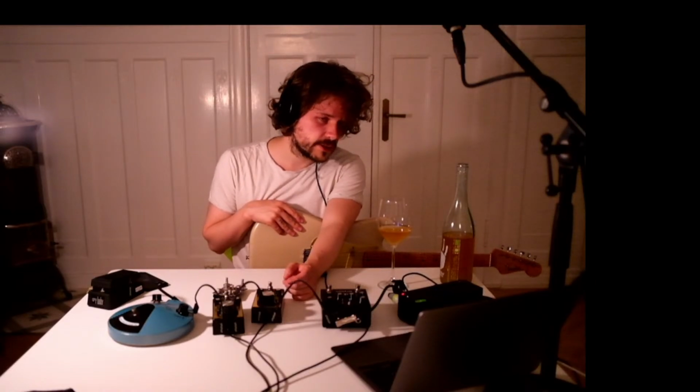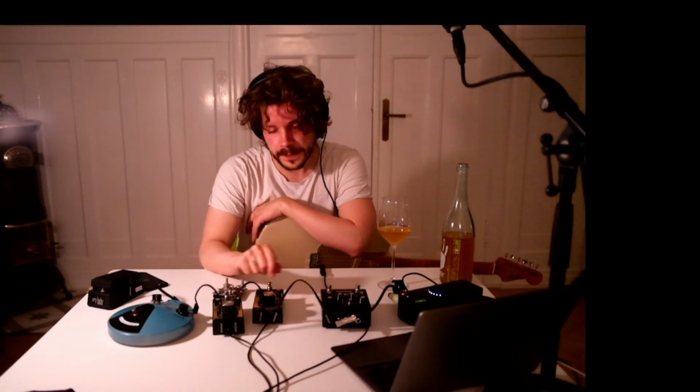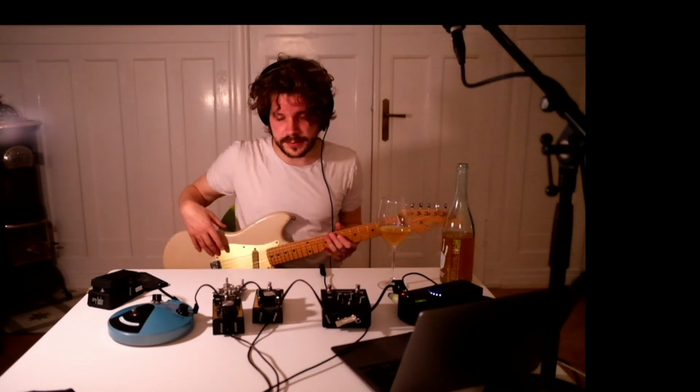So by using a 100k potentiometer at the beginning of this circuit, I'm changing the impedance, or the sort of overall EQ curve, of your signal even before it hits the actual circuit. Now there is a 2.2 mega ohm resistor in parallel with this control, so that does potentially decrease some of that effect, but I think it's still in there. And it sounds decidedly different if you stick a 500k pot in there instead, so I stand by that. It allows for some really sweet in-between sounds.